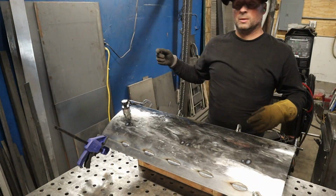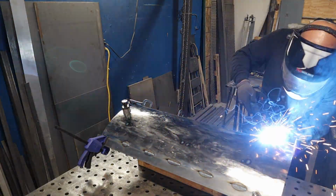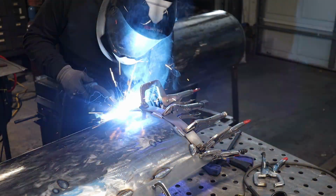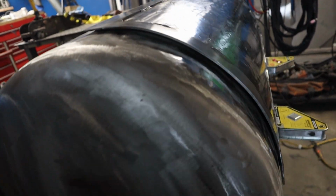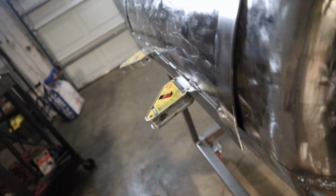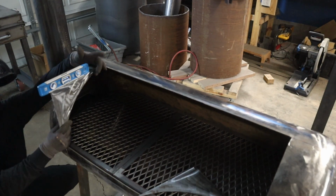This did not. This is the door to the cook chamber, and you might be thinking to yourself, hey, wasn't there a square door at the initial sneak peek or on the thumbnail? And yeah, there totally is, and that's because new 1/8-inch thick air compressor tanks are thin wall. When they're rusty and shitty, they warp like crazy when you cut out the door and weld on flanges, and these gaps are just too much. I tried with a jack and chain and everything to re-bend these, but there was a twist in it. And I basically just gave it the finger and said screw it.